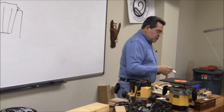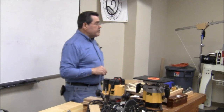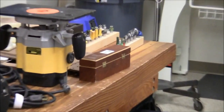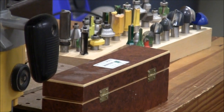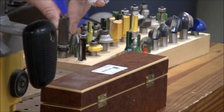I have an assortment of bits. A piece of 2x4 and a 13mm brad-point bit lets you make as many router bit holders as you would like. You can buy fancy cabinets if you like, but it's pretty simple to whip up something. Don't drill the holes with a half-inch bit and then try to get half-inch shanks in and out because it'll be too tight — when the humidity's up it won't come out, and when it gets dry they'll flop around. But a 13mm bit gives you enough clearance so they slide in and out very nicely.